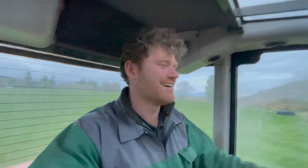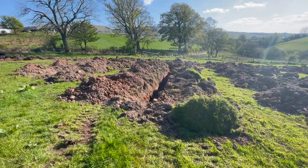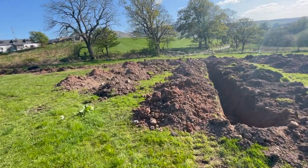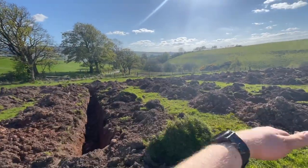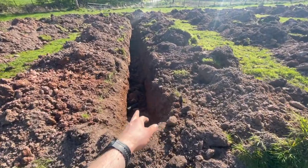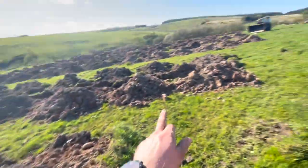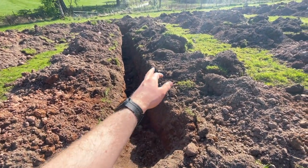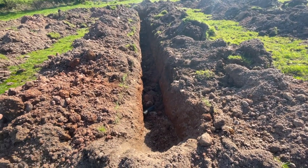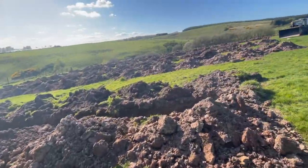This is what I'm doing right now - filling in these holes. Dad's away to get joiners so I've got all the pipes in these drains. They all go down to the main drain we put in down the bottom and we've been shoveling the sides of the bank in to cover the pipe. We've got the ends blocked on all of these so they're not filled up by anything that's not meant to go in. The sides are on top of the pipe so that when I shove this in it doesn't flatten the pipe. A couple of short runs here and then they just get longer and longer.